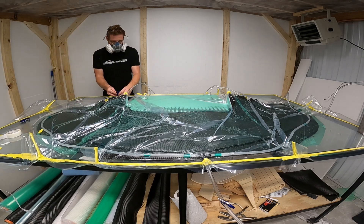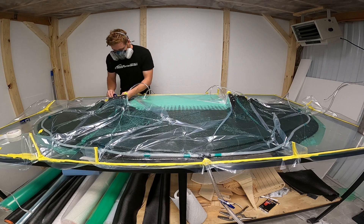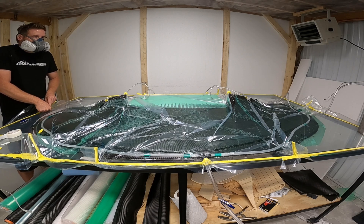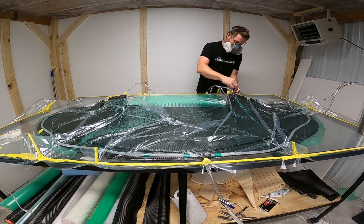I keep trying to fix holes but I'm not really winning. I decided to clamp off the diffuser suction points once the epoxy had reached them so it will stop pulling from there - got both of those done so it's only pulling from the back of the mold.